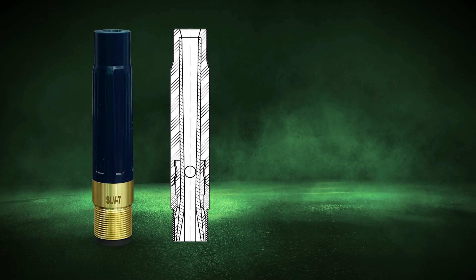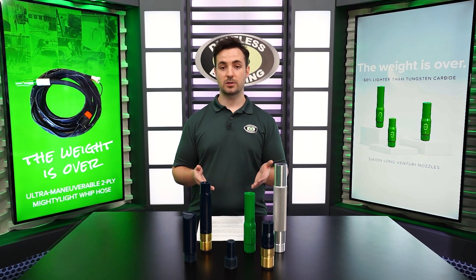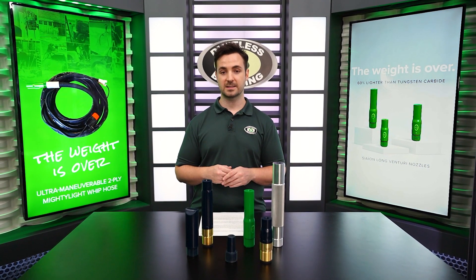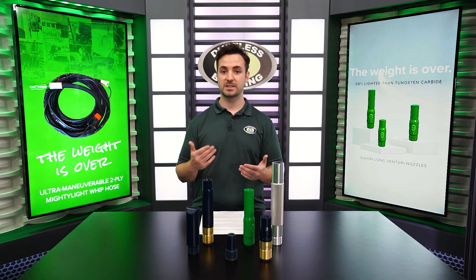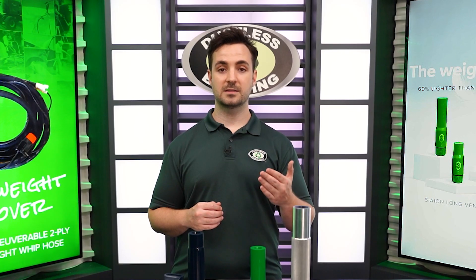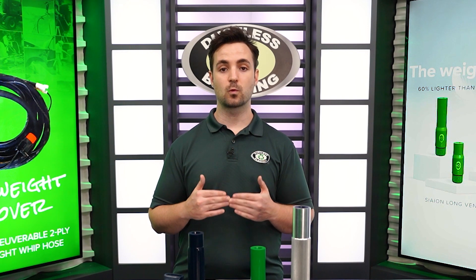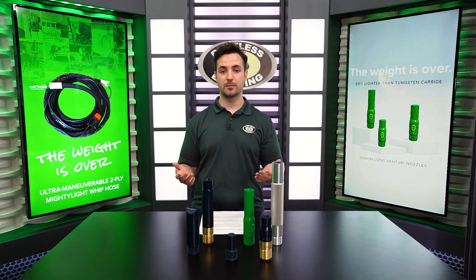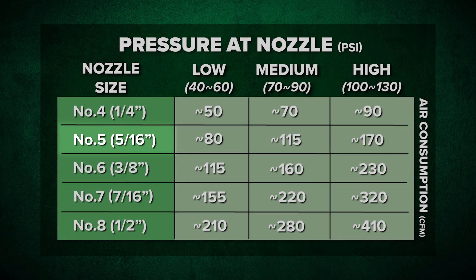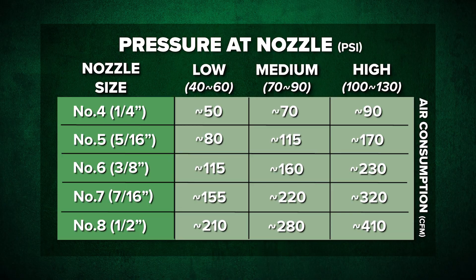The measurement refers to the narrowest part on the inside liner. These different nozzle sizes are used to match the nozzle to the correct size compressor in order to always have adequate airflow, as well as consistent and predictable removal rates. The nozzle size and CFM are paired correctly to hit a designated production rate as well as a set nozzle pressure. For example, our DB500 Mobile S is paired with a number 5 SLV nozzle so that even at high pressures, you still have adequate airflow and plenty of supplied air.